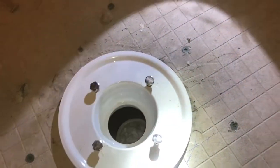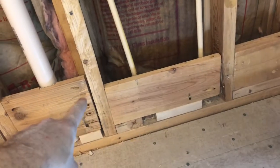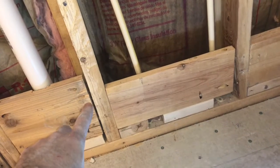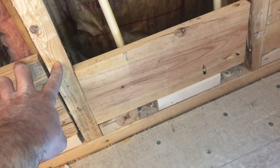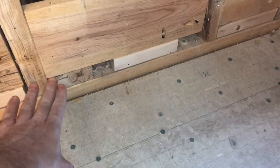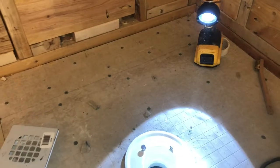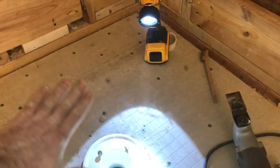So when you put this in here, this is supposed to be flush. And what you do here, your PVC goes in between here, your PVC liner, and it's going to go up on the walls. If you're doing your shower pan for the first time, other people who are experienced know this, but don't put any screws into your shower pan unless they're about this high, maybe 8 inches or so, because you're going to have your mortar coming down this way. And I actually got some pre-pitch and some quick pitch sticks to put in because I want this done right so your water drains downwards.